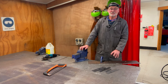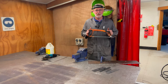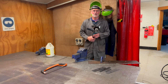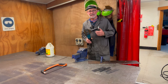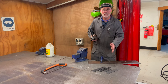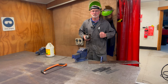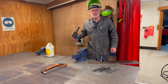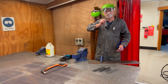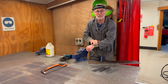Now we need to cut all of these parts out of these pieces of steel plate and there are several ways we could do that. We could use a hacksaw but that's going to be really slow and hard work. So I've elected to use an angle grinder — this is a 4-inch, just over 100-millimetre diameter disc. I'm using a 1-millimetre cut-off disc to rough them out, then change to a sanding disc to smooth them to the final shape. This is noisy and dangerous equipment so I'm wearing earplugs and a full face visor. I'm also covering my watch with a bit of fabric.